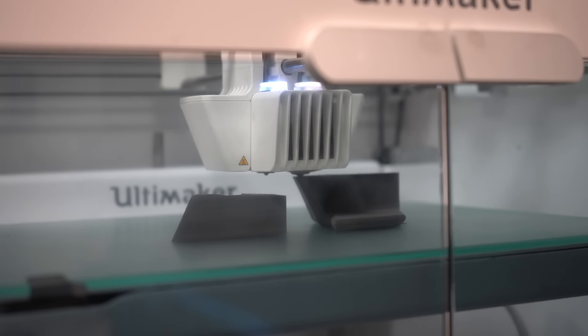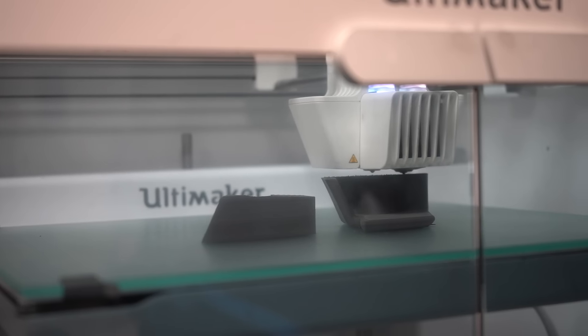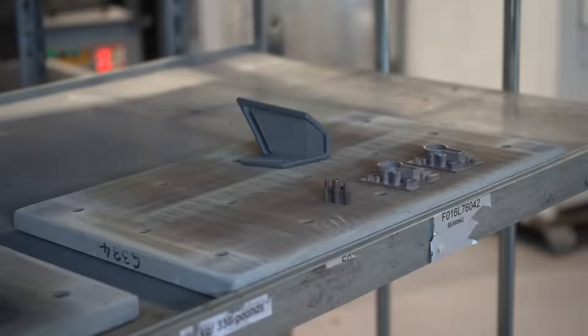I'm Samuel Oberfos and my role at CMG Technologies Limited is research and development in materials and new technologies for 3D printing — mainly metal 3D printing and ceramic 3D printing. Our technology is based on sinterable materials. When one prints the green part, it goes through a sintering oven where the binder is removed to get your metal or ceramic components. This technology is complementary to metal processing technologies like metal injection molding (MIM), because with this technology one could produce components — metal or ceramic — which could never be produced by MIM, such as planetary gears, very complicated medical components, and high-detail machinery parts.